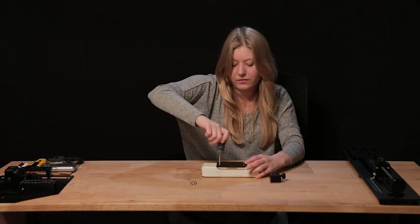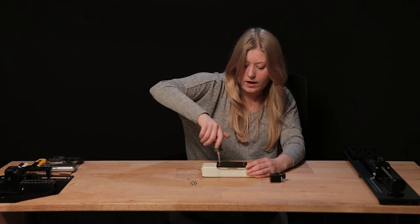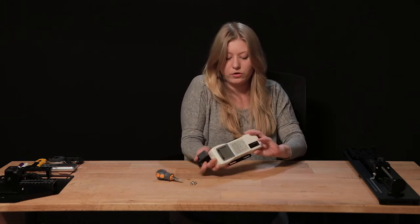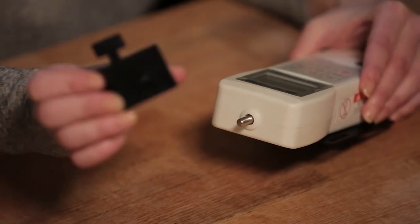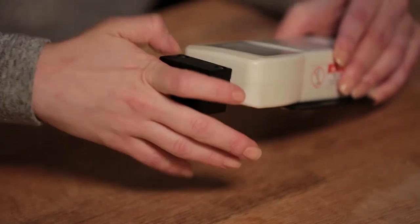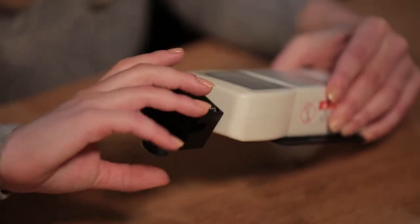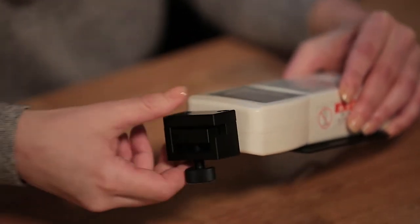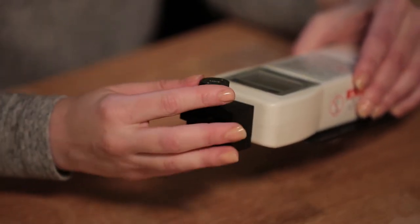That's part one of the digital force gauge assembly. After screwing that in, you will attach a vice clamp to the front of the force gauge. You'll see a thread sticking out with a hole to place it on — turn this, but do not fully screw it on so it's completely taut. Turn until you hit the tightest point, then back off one turn to keep it loose and free, with the knob upright toward the top.